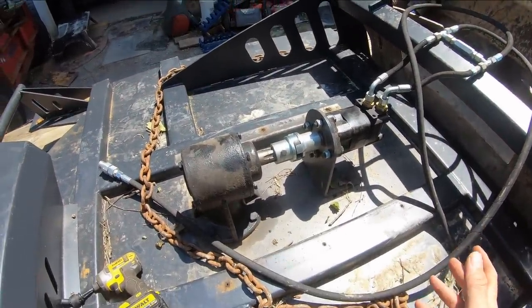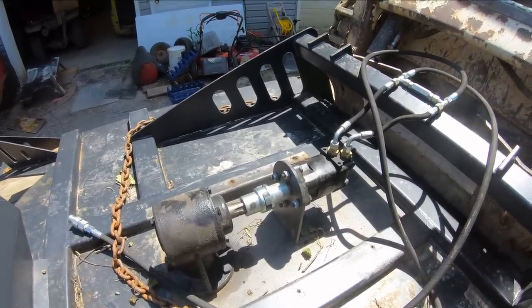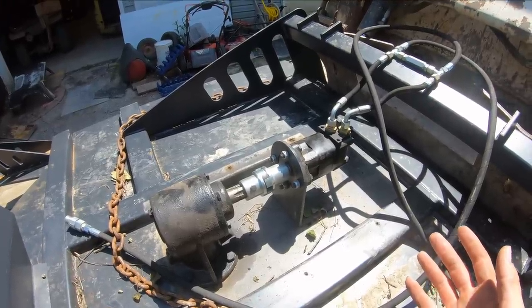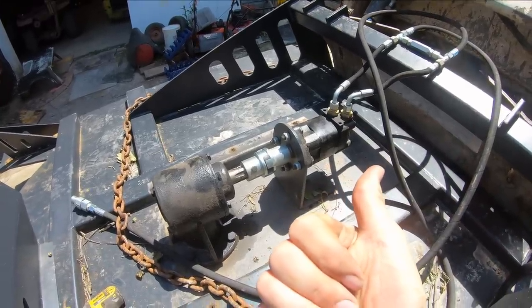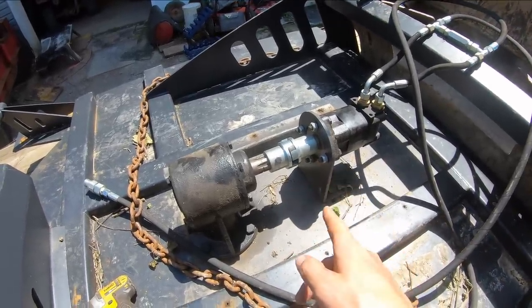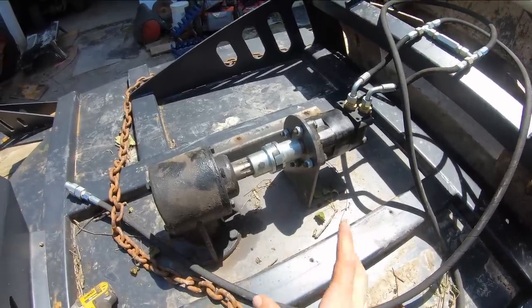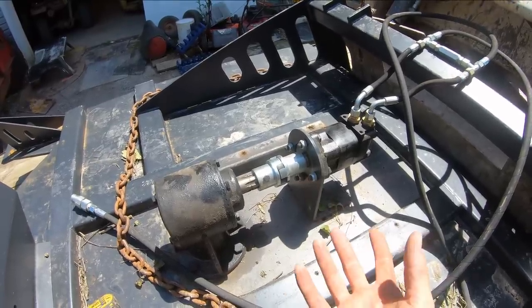I picked this thing up for about nineteen hundred dollars, plus I had almost a seven-hour round trip drive to the auction site. So I've got just over two grand in it by the time you add in fuel, not really accounting for my time either. To buy a good quality one of these you're looking at easily four to five grand. So far I've got blades that threw themselves off in the first five minutes and a Lovejoy coupler that's missing half the rubber isolators already — that's going to fail in the next five minutes or less, I'll pretty much guarantee it. The only saving grace is it's still runnable without the isolator; it'll just clang and bang more. I should be able to pick that up at the supply store for a couple of dollars.